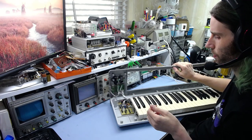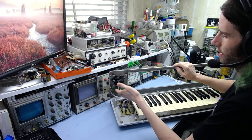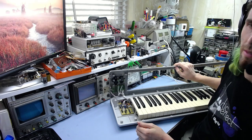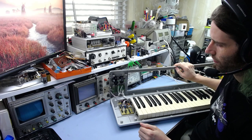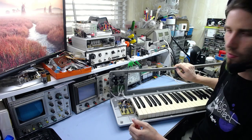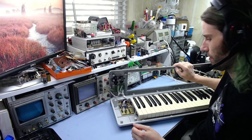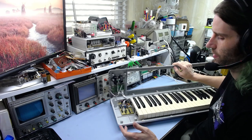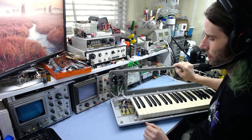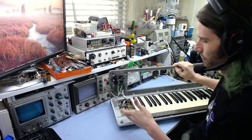I had to change the code a little bit to make sense with that. The three LEDs aren't actually connected to anything, so those don't light up. To get those working you'd probably have to add some sort of shift register or I2C port expander to the design, and I just didn't want that complexity. If I used a bigger microcontroller I could probably handle it, but I just wanted to use what I had on hand and get the basic functionality working. It doesn't really matter about the LEDs. So this is all working at the moment — screwed into the case.